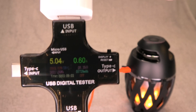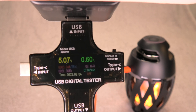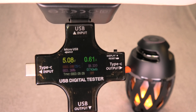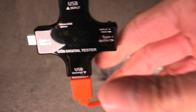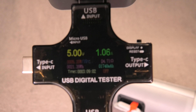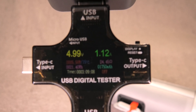Next is the Decau illuminated speaker, which only pulls 0.6 amps — it doesn't even use the full capacity of the Apple charger, and of course the bigger charger makes no difference here either. Finally, the Soundstream Picasso, which also says it will pull 2 amps. In practice it only pulls about 1 amp with the Apple charger and 1.1 amps with the JBL 2.3 amp charger, so it does not pull as much as its specs claim.